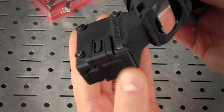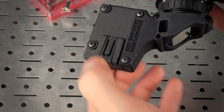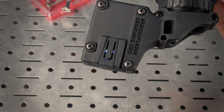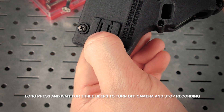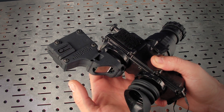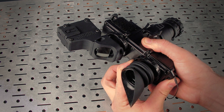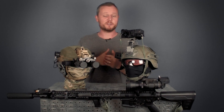Install the goggles in your night vision arm, flip them down, and press the only button that you can feel. It is raised so you can quickly bump into it, press it, and listen for the record sound. You can also double check by seeing if the blue light is slowly blinking — that indicates recording. A side note for PVS-7 users: because of the way mirroring inside works to split one image into two eyes, it is best to slide the night vision recording system all the way to the center closest to your nose bridge for that fuller circle effect.